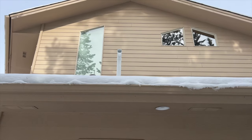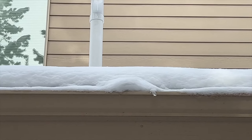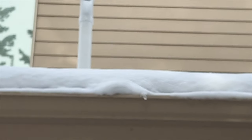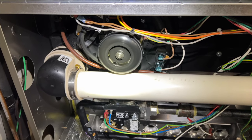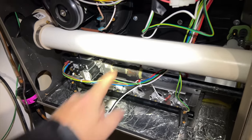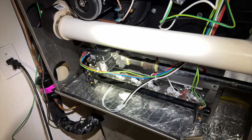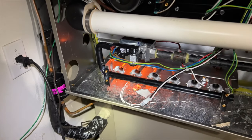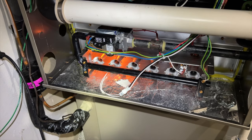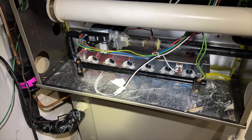There it is - there's a piece of ice, an icicle hanging off the end of it. It should be a complete 90 coming down so stuff doesn't fly into it. The water is dripping out of it - that's not good. Got it back together, going to try this again. No bubbly noise anymore - this whole pipe was full of water. The long section that goes across the garage is probably not leveled properly, so it just gets full of water and messes with the pressure. Now we're good - the igniter is going.